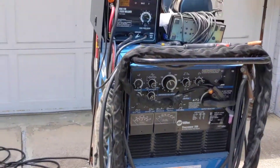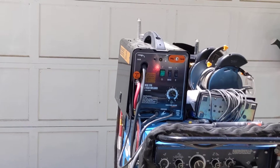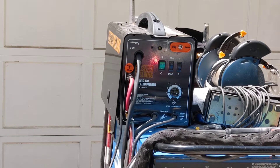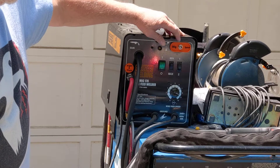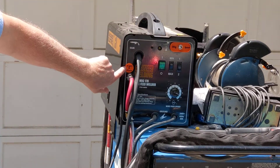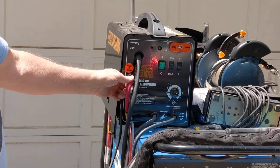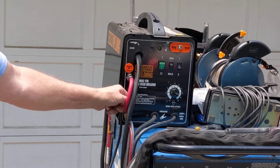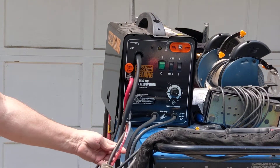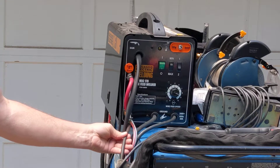There's the MIG-170 and you can see it's got some extra connections in the front and I've modified a few things. There's a switch I added that switches from MIG welding to spool welding. There's an indicator that shows argon flow, a connection that routes the argon into the gun, a gray cable for speed control and weld on/off, and then this big cable for DC power.